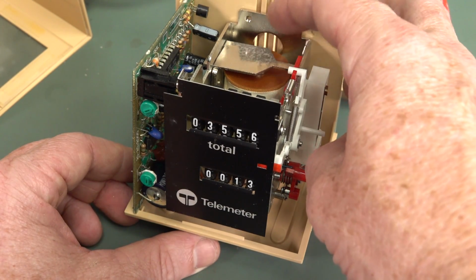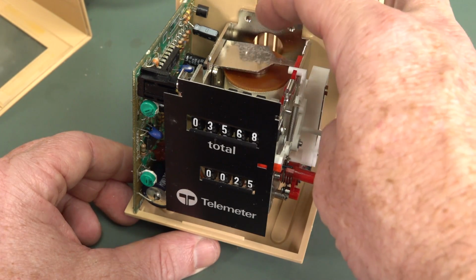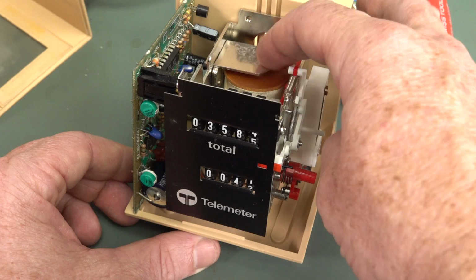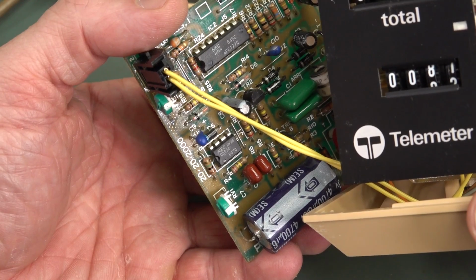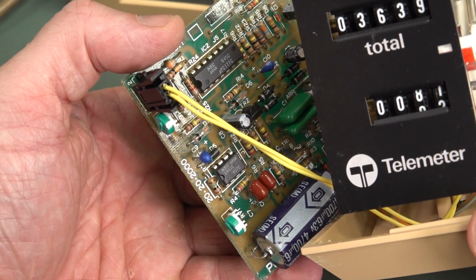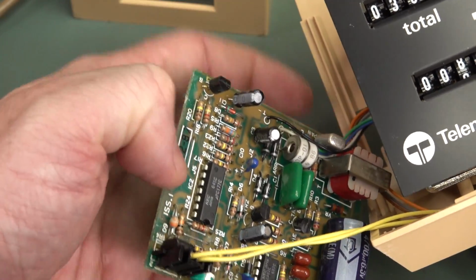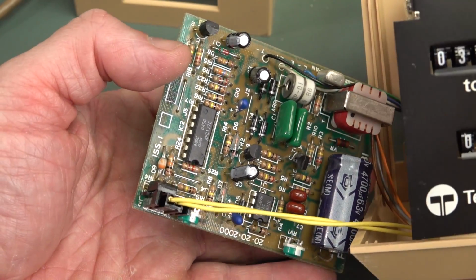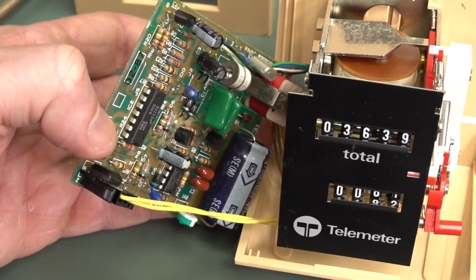There you go. So just apply one pulse to the coil and it's just going to count up like that. And you can reset this one down here. Beautiful. And that's a Nichicon cap. Thank you very much. There's not a lot in there, is there? Just some sort of NEC. What is that? I don't know. An op-amp job. What's up the top? A UC177, once again NEC, and got ourselves a spark gap there, a little tranny down the bottom. And there's not a huge amount in that at all. It's just counting telephone line pulses or whatever. Is it some sort of call counter, maybe?